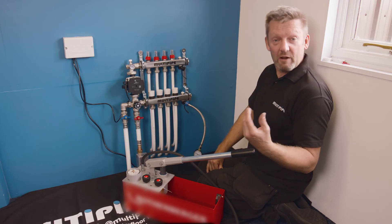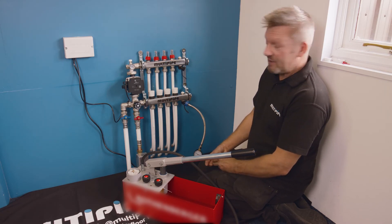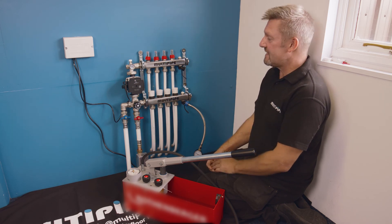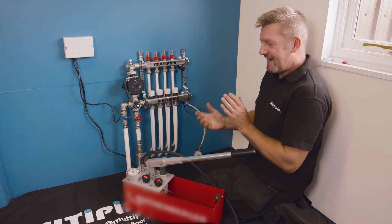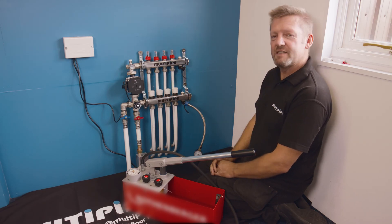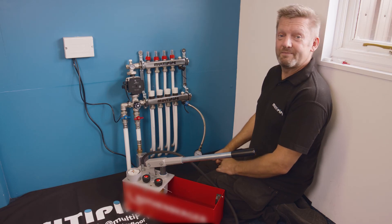Air pressure testing is normally required when you have a worry or concern about frost — the building might not be airtight, so frost can be a danger or cause damage to pipe. Air pressure testing is almost exactly the same but you're using an airline to pressure test rather than water. The big difference is when it comes to air pressure testing, we're looking at much lower pressure — no more than one bar. Air is far more searching, you can compress air, and it's actually more dangerous, so maximum one bar for air pressure testing. But given the choice, wet pressure test every time — far higher pressures, far better for ballast for the pipe, and far better for the screeding company as well. Thanks for watching, all the best.